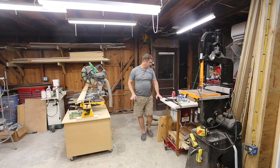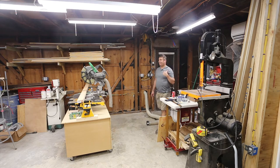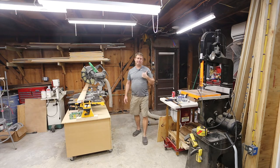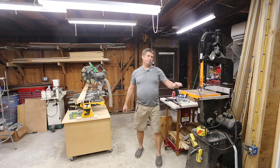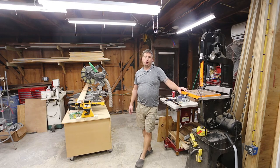For right now I'm just controlling it with my breaker panel over here. It's on a dedicated 20-amp circuit and it does make the lights flicker a bit. I think I've only got 100 amps coming into the house, and one of the future upgrades is to put 200-amp service in. That's not a today project, as they say.